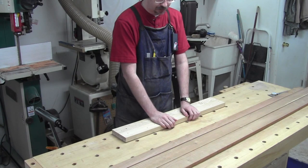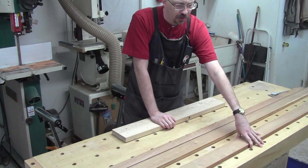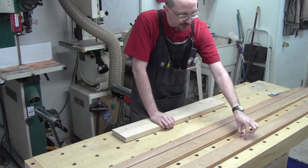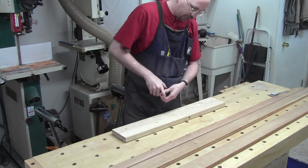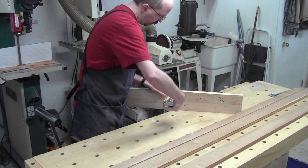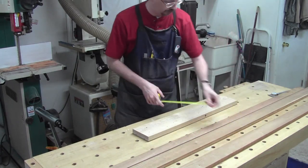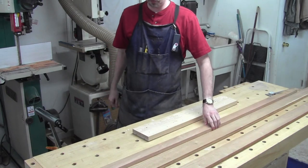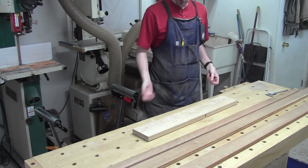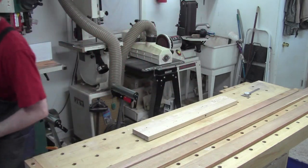What I'm going to work out now is I've got these pieces of skinny stuff — some of them are kind of long. I just need enough to get a thick enough profile, enough coverage to make a profile on it. I think for the stiles — the tall ones — I can do it with just this board alone, because three quarters of an inch will be enough to profile it. So I can get two bits that are three quarters of an inch out of this. We're at about an inch and three-sixteenths — almost an inch and a quarter. So we've got plenty of stock. I think we'll use this one for the center because I only need three quarters on those. I'm going to get these cut roughly to size, then I've got to glue them on before I can veneer. So that is next — a little cutting first and then I'll bring you back.